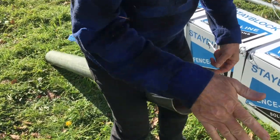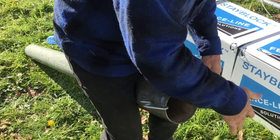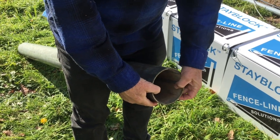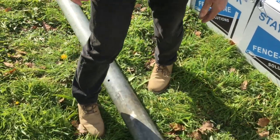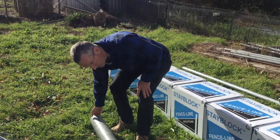Stick them in the end of your post, the same as this one here. When you drive a post in the ground, the soil goes up the middle and it's really compressed — it's like concrete. Well, that's what holds the product to the post. And when you try and pull the post out of the ground, because it's stuck to the soil, the outside pieces stop it coming up.